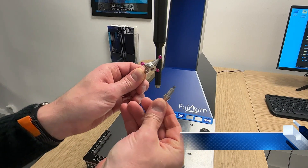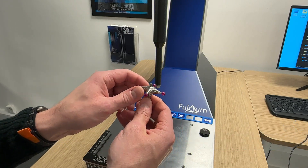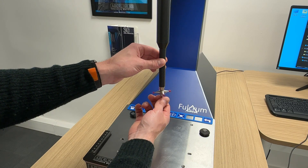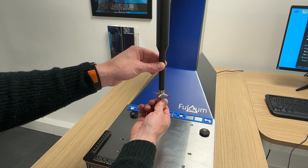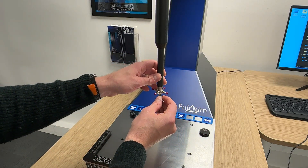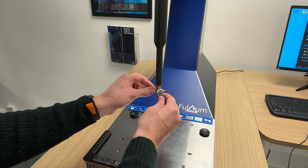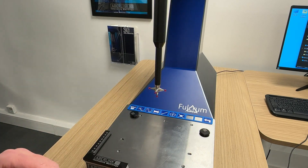Once seated, use the tension bar in the through hole to gently give it a nip. To fit a star stylus, firstly feed the Z-minus star into the through bore of the star assembly. Then locate the M4 thread on the end of the quill and gently thread the stylus until it seats against the face of the quill. Back the thread off slightly and feed the tension bar through the cross hole on the Z-minus star, using your left hand to hold the star assembly square with the machine axis. Now rotate the tension bar on the Z-minus stylus until it nips up and clamps the star assembly against the end of the quill.